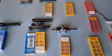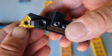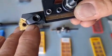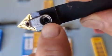I'm getting six uses out of the triangle. The other one is a trigon — it's triangular but it's got six sides, so you get different working angles. You can get it in all different chip breakers. It's the same thing — negative rake, 16 millimeter — and I had to mill that down as well. It's got a grub screw here and here. The best part is this one takes the same allen key, whereas the other is slightly different.